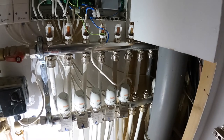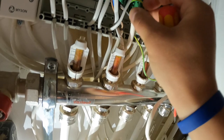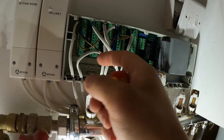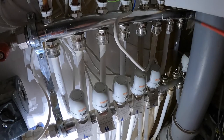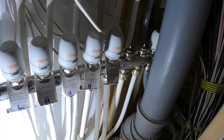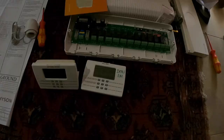They took a feed out of this spur, came across and permanently fed these two wireless switches with live and neutral, then switched back on these channels. They cut the earths out and only switched two zones, so a lot of zones had no control at all — the water would come in and that floor would be red hot with no control whatsoever. Some of them didn't even have heads on. It's quite a gummy old system. They might want a plumber to do some descaling on it, but we're going to rip all this out and start again.